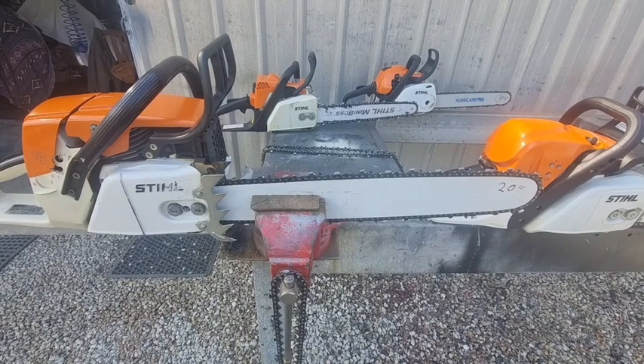The only time you should extend the bar on a medium-size saw is if you put a skip chain on. You could do this from a 35 cc saw up to a 45 cc saw — put a skip chain and a larger bar on, and go for a narrower kerf. Generally speaking, the 043 gauge is for smaller saws up to about 40 cc, then they jump to 050 gauge which can handle up to around 50 cc saws, and then you move into 058 and 063 gauge.